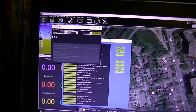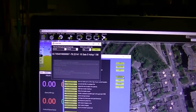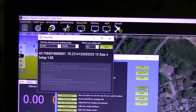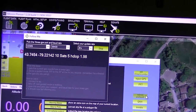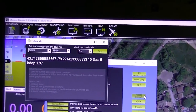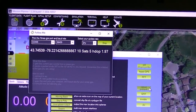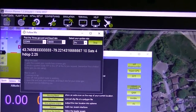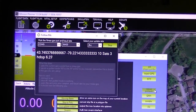I connect, get my altitude setting, and as soon as I do, I start to get data from my Bluetooth GPS. And once I have that running, then either using the Bluetooth GPS or the USB GPS, Mission Planner now has information as to where it's located. Next step is to put the drone into loiter mode and tell it to follow me, and at whatever position it is, it will start following that distance away.